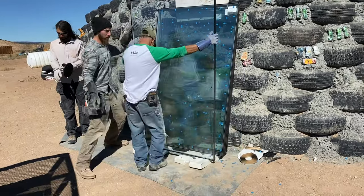I have a lot of experience, not just as a glazer in the industry, but I've lived in Earthships for 16 years. And the Earthship that I own, all of these bottom plates are rotten, and my windows have actually slipped right out. So there's 2-inch gaps all the way across the top. I had to bomb a whole bunch of acrylic just to put a Band-Aid on it, because a lot of moisture gets in between the glass and gets down onto the wood.